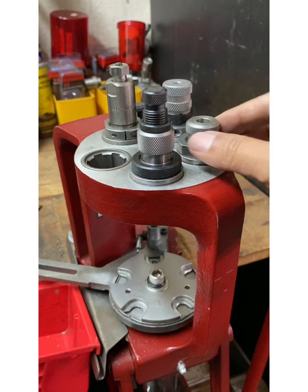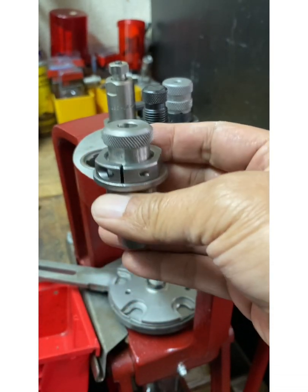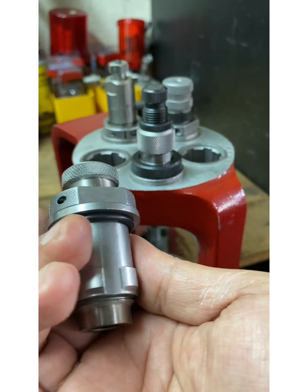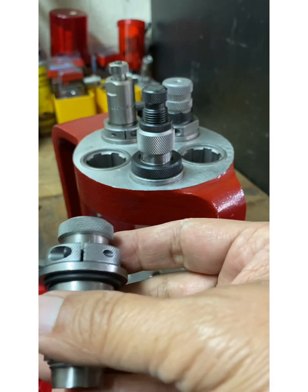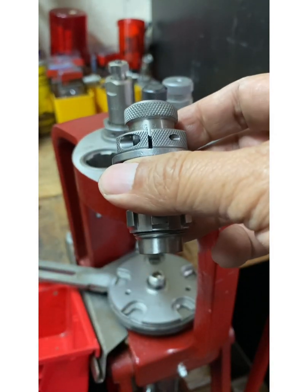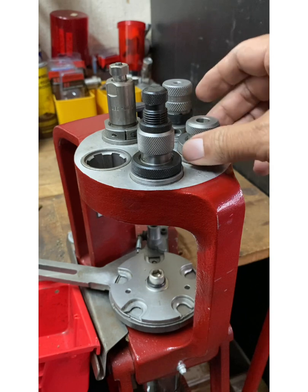The next die that comes about, I'm using my 308s in a semi-automatic rifle. So this is a small base body die, and this is another RCBS unit. No, this is a Redding unit, sorry. It's a Redding small base body die, and it is specifically for the 308. It bumps the shoulder, makes sure that the back end of the case, at the case head, is down to minimum dimension, makes it easier to feed in a semi-auto. You never have any trouble if you do this.